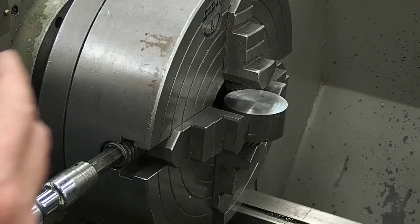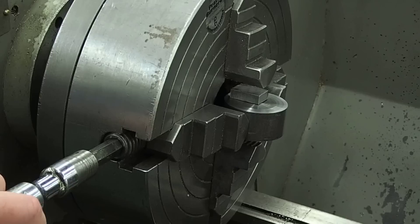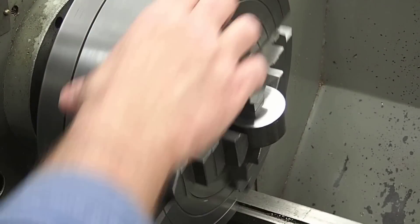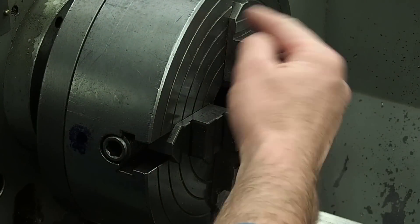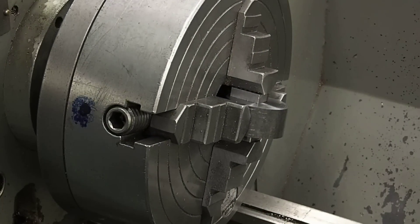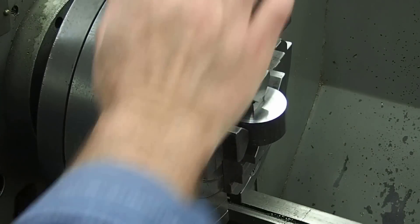What I can do is use a shim - just a piece of steel, aluminum or brass will work - and set it between the chuck jaw and the work on the finished sides. I'll take this jaw and move it in, then rotate 180 degrees and do the same thing. There are marks on the side of the chuck and I'll just get these so they look fairly close to each other - it doesn't have to be perfect because I'm facing, not turning a diameter. Make sure everything is tight - that's the trick with four-jaw chucks.